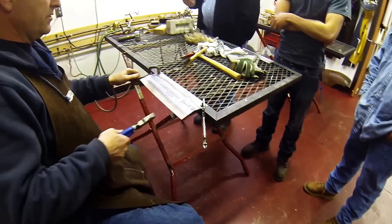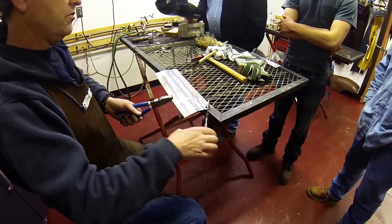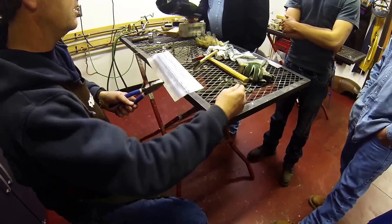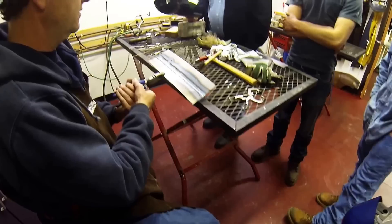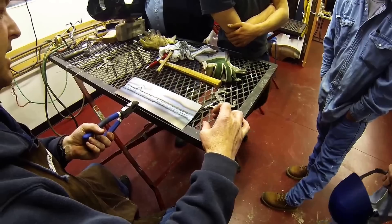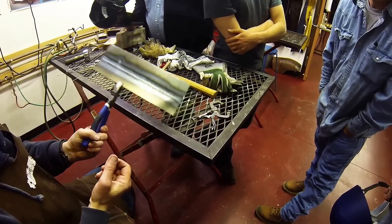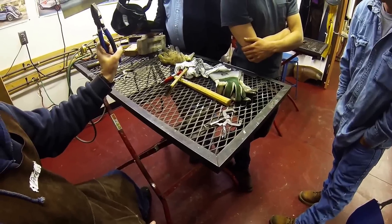The telltale sign on the back side of an oxidizing flame is you'll have a huge amount of oxide — big heavy flakes. Overall it looks fairly consistent all the way along. It should planish out pretty well and it's almost flat.